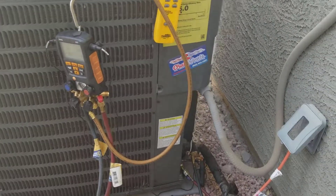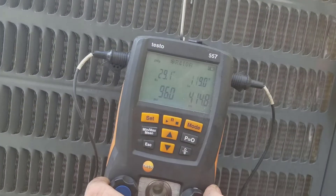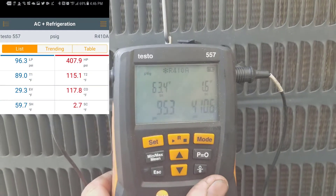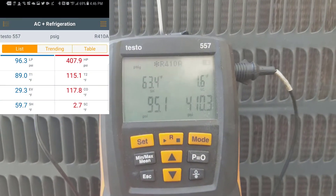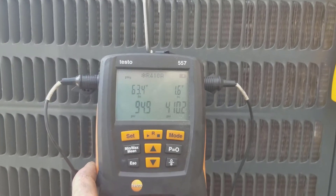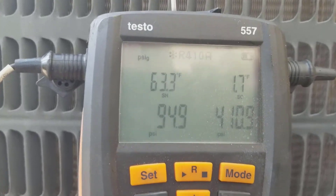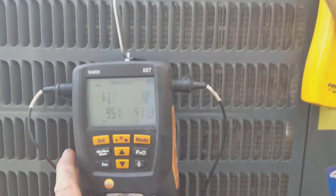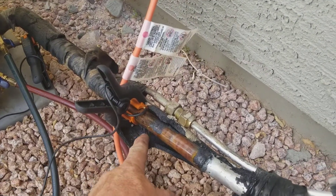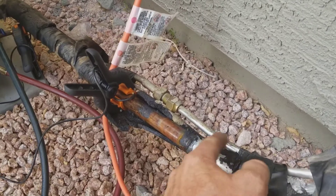The ductwork, the install. And look at this — of course, it's low on refrigerant again. 410 PSI might seem high for the refrigerant right now, but R410A, when it's like 90-something degrees in the house, that's what you're going to get. It's only got 1.7 degrees of subcooling and 63 degrees of superheat. I noticed when I pulled this back a little and put my probe on it, this is all oily. Look at this — this is Chainsaw Charlie for you.